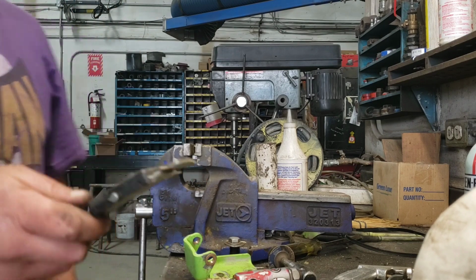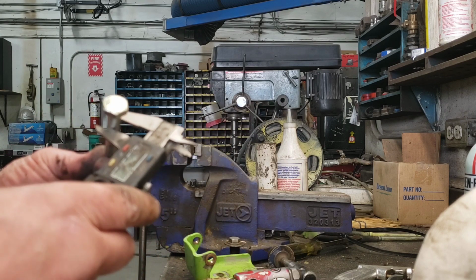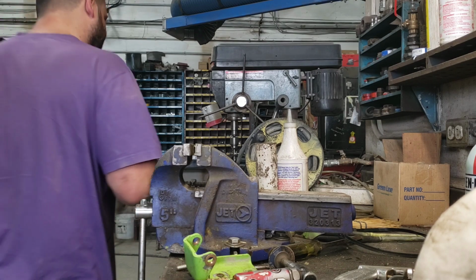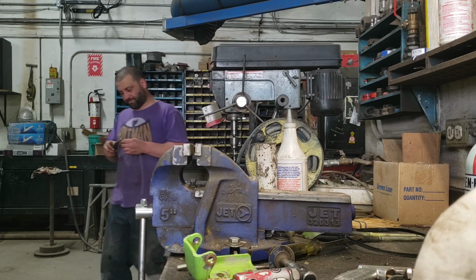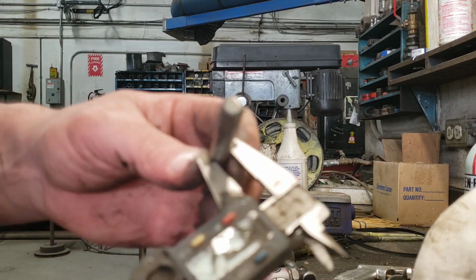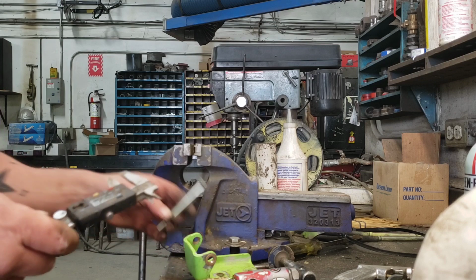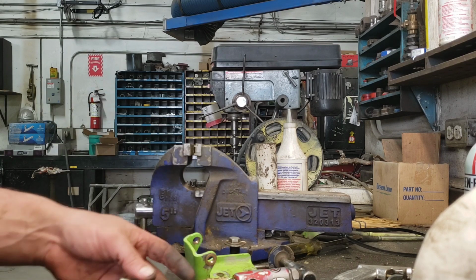These are great. I've die ground those before to fit the bushings, but because this is metric and all my drill bits are gonna be SAE. This is 3/8. I think I need 25/64, but I might just run the die grinder in there. Yeah, for sure. I don't know. There's no 25/64, so.